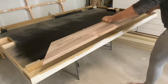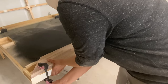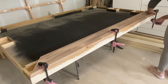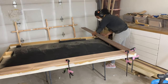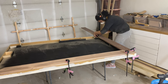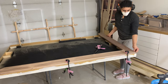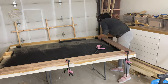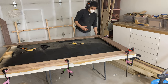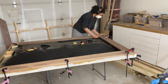I cut slightly bigger and then kept trimming a little at a time so it fits perfectly. Honestly, cutting angles on the miter saw won't give you the perfect cut, but my table saw wasn't set up to use my crosscut sled and I didn't want to waste time. If you're going to do this, I'd recommend taking the time to set up your crosscut sled because the angle will be much better. I dry-fit 100 times. I worked on this part for about three days, always leaving it in clamps overnight to avoid any bow or cupping, since at night my shop was too cold and during the day it was warm from the heaters.